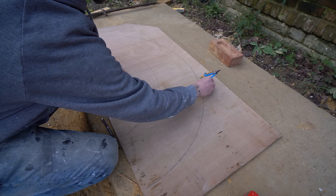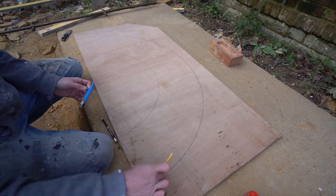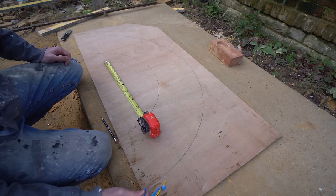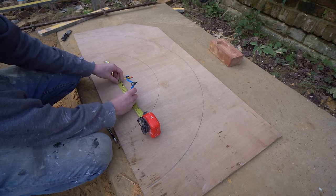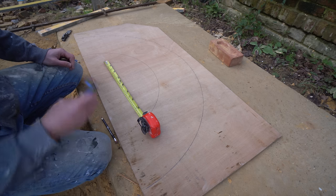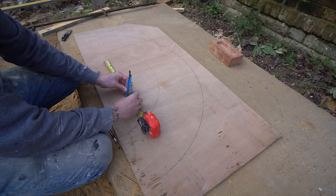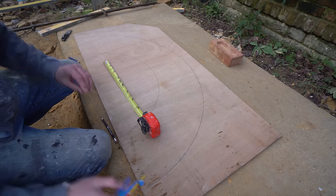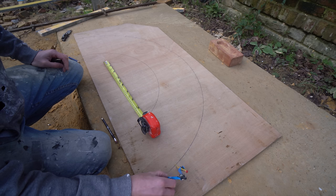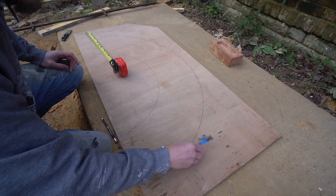So what I'm going to do is I'll quickly run these around here. Once you have got those marked out on the extrados, I must point out that you want these on the outside. You want to go around again — but if it's 73mm, you want to take off 10mm for the bed, so it's 63mm. Mark off 63mm and that will give you your 10mm joint for every brick.